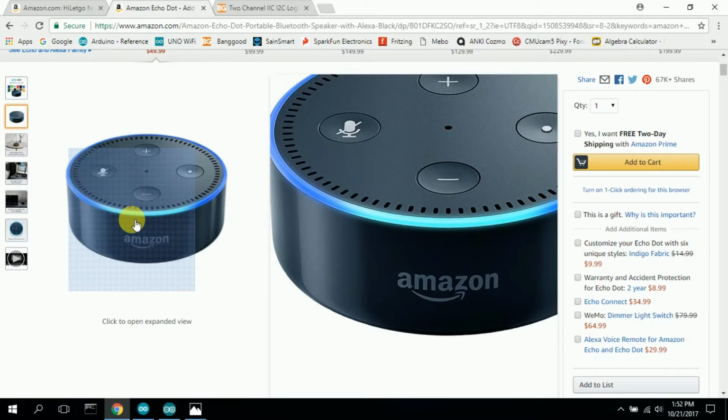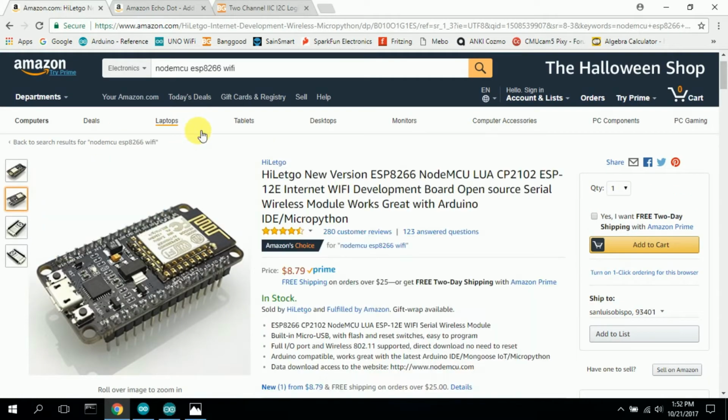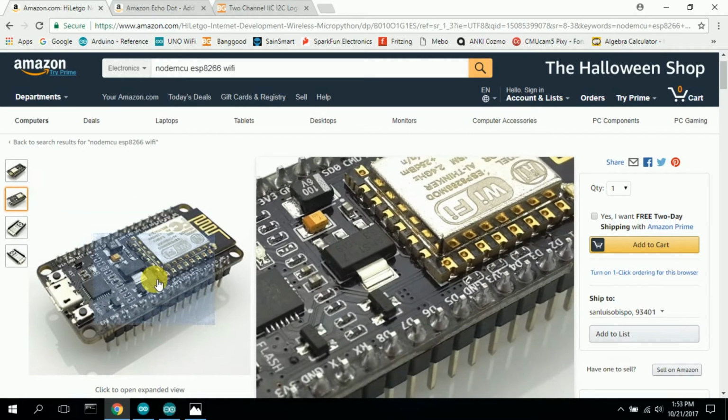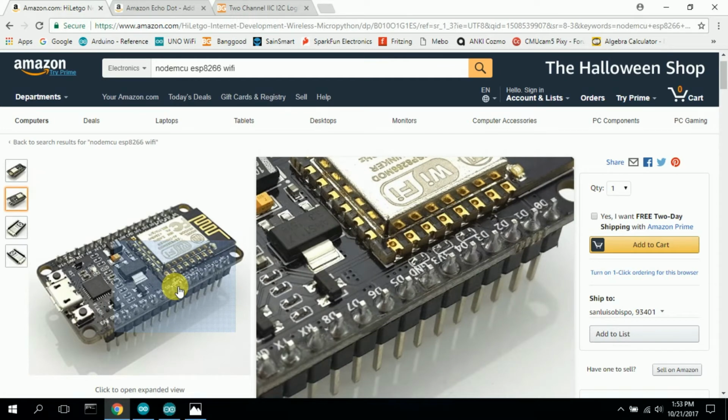So I think the software that I load onto here, which is called FauxmoESP, it's a library, allows you to create devices using unique device names, and then you can address those device names using the Amazon Alexa Dot. And this will trap it, and depending on what you code, send a signal out D6 or D7 or D1 pin to light an LED or whatever you want it to do. In my case, I had it trap a device name like turn light 1 on. It would trap it in a case statement and then send a capital letter A serially to the Arduino.